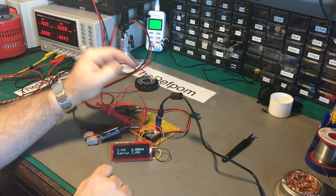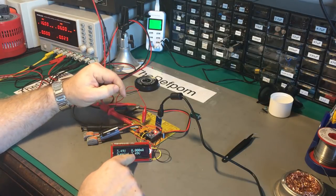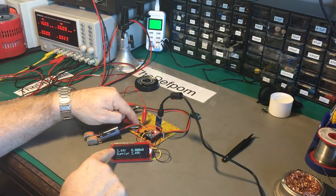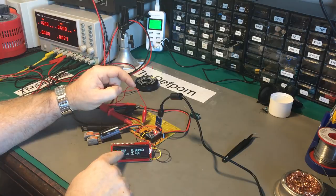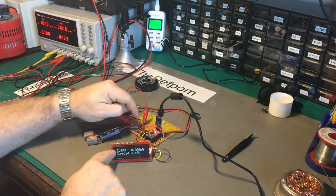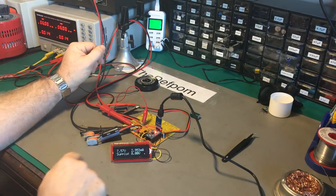This is preliminary but will be better once I redesign the board. The software can stay the same, just telling it which pin to use for voltage input. Right now it's doing it by calculation - that voltage is measured at the device under test and this one is compensating for the shunt resistor drop. When you've got a heavy load, that voltage ends up dropping below the supply, and that's what the voltage drop calculation is based on - it is actually working.